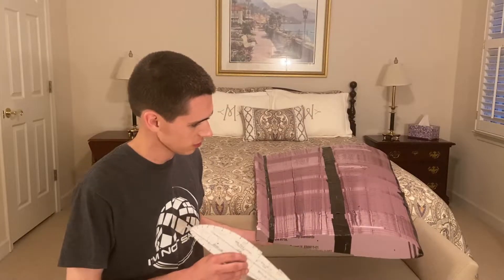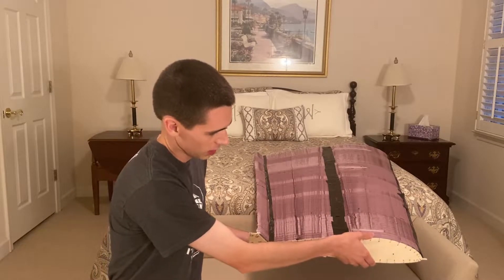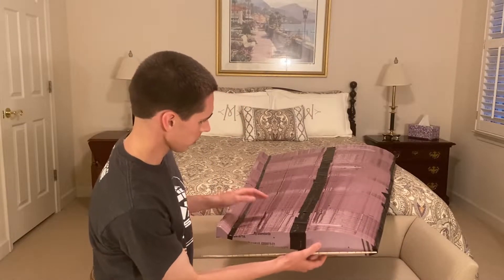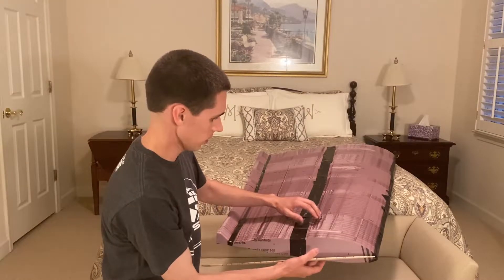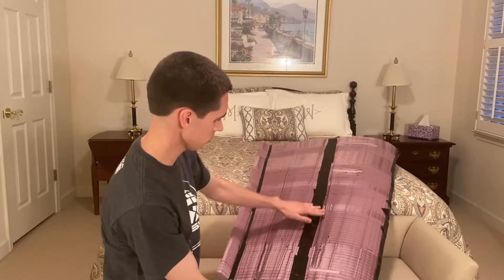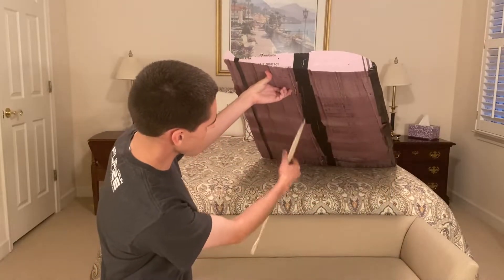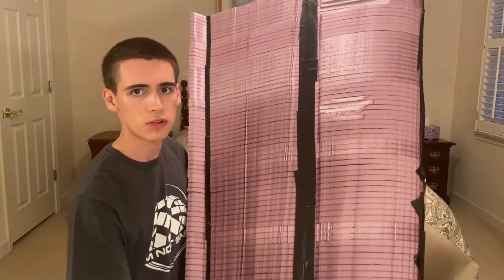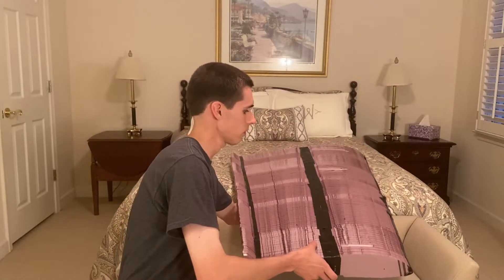As you can see it was a huge ordeal to make this section of wing using these templates and cutting out to that contour, but it made a pretty good shape. We definitely have a swept wing — it's not perfect, there are some imperfections where the cutter bounced slightly, but the obvious shape is there. There's the spar trough where the central wing structure will go. There's a bit too much heat here, so increasing the wire tension and decreasing the heat should allow for a more accurate cut when we get to proper aviation grade foam. But as a test, this is a good proof of concept showing the method will be effective.